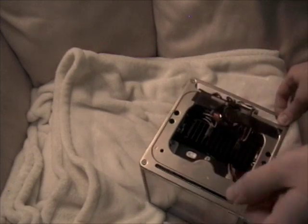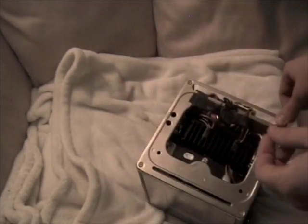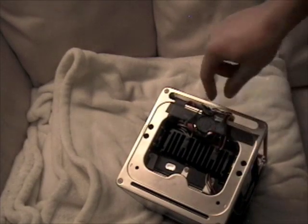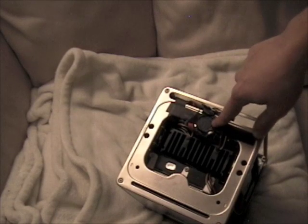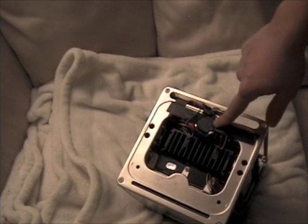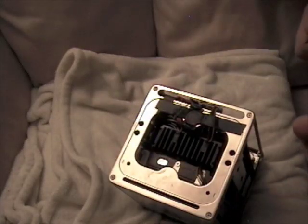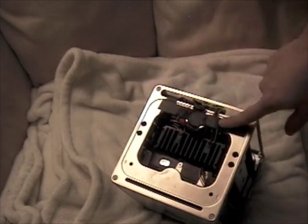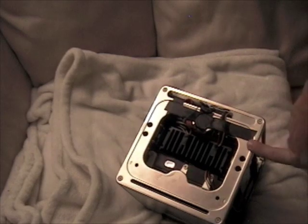I moved the original board and extended the touch capacitance switch to where the hole was. I used a US quarter — George Washington's hair was just textured enough so that I could solder a wire to the quarter, put it in here, and I wrapped it basically in some electrical tape so that it wouldn't short out with the rest of the chassis of the cube.